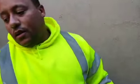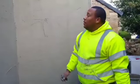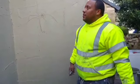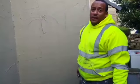Now I'm going to show you an internal corner. You're meant to overlap into your corners, it'll give you a nice strong angle so you won't get any cracks down there. Some people don't do it, they mesh into corner, mesh into corner. Sometimes they put a little slip in as well, but I'm not messing about with that. I'm just doing a full leg piece and I'm just going to stick it in there. Now I'll stick another piece coming down there.